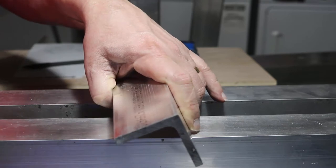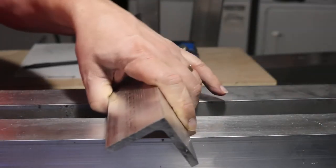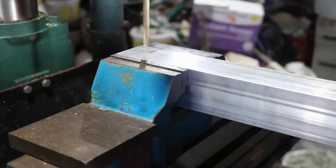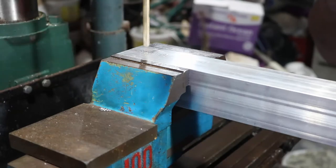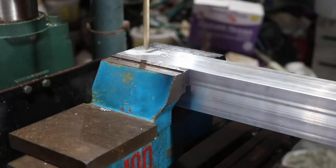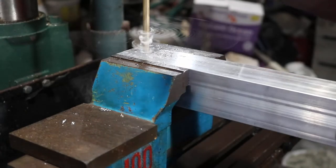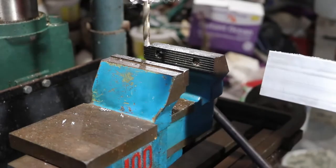Once I have this all built and assembled, by the end of this video I'll have the preliminaries set up so you can see what it looks like. It all needs to be checked for level on the floor where it's going to go. These are the easy pieces to drill - the cross pieces. They're short, easy to fit in the clamps, so I use them as a template. I'm going to drill as precisely as I can each hole. From the belt sander build, I use an aluminum bar as a parallel; I scratch it with a marker to mark where the hole goes, then drill through.